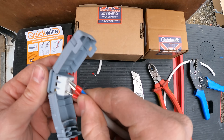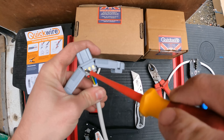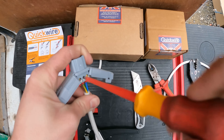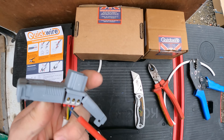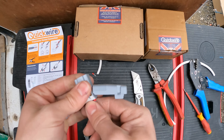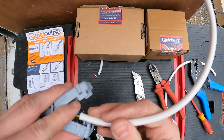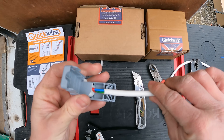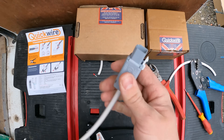So there's that flexed-up lead with the crimps on — I'll bang that in the plug side now. You've got live, earth, neutral, in that order. Nicely in there, nice and neat. You get your cheap and nasty screwdriver from Screwfix — which is really good for the price, by the way — and connect them up. Pretty quick. So that's that connected up, nice and tight. Then one side's got the cord grip, the other side's got the lock on it. You pull the cord grip side round first, bang your flex in there nice and tight, click them together — and that's that. Done.